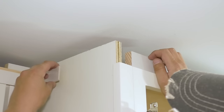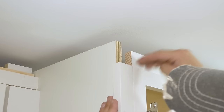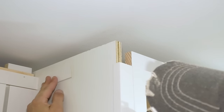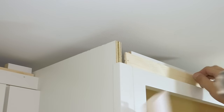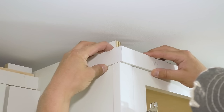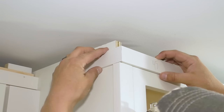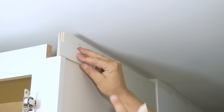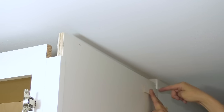So now what I've done is I've ripped down what I'm going to use here — quarter inch. That is going to go from here to the bottom of this piece like this. This is leveled, by the way. When I put the cabinet in, I made sure that this was the same as these cabinets right here. So it's going to go from here over to here just like that. Then I'm going to put my filler piece in right here and do my 45 like I did everywhere else. Match these up just like that, and then my crown will go around like this. Sweet! I think it worked out. So then over here, this will be the same thing — put my filler piece in, put this piece in, level across this way, and it'll be even with this wall. And then I can run the crown right down the hallway.